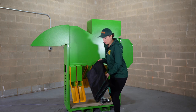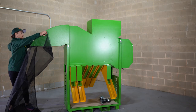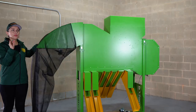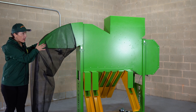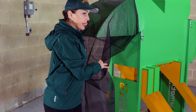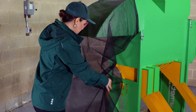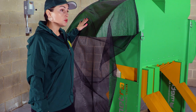There is also an accessory called a net. I'll show you how we use it — we place it over the air duct, just like this. Once the machine is working, there is a lot of chaff, pieces of straw, insects, and light impurities coming out from the air duct, and they're going to create a huge mess around your cleaning site. This net allows you to keep your site clean and nice. Only some dust will come out of the net, but all the large impurities you can easily collect within that net, place it over some kind of cart, and keep your site clean.